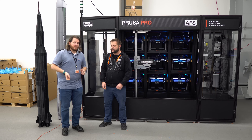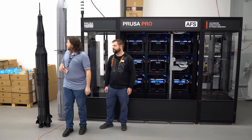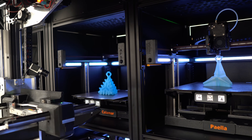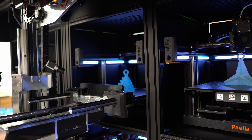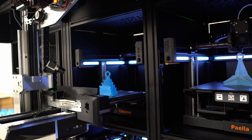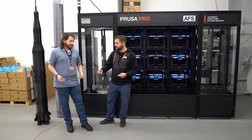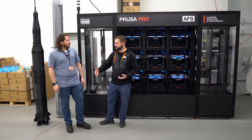Then you have to turn the dials up a little faster to catch up. Human factors are one of the biggest issues for failure amongst any business. Another point — this also comes into why we chose this size of print bed. Many people ask why we didn't make it XL size. XL size means print time is approximately one day or more. If from a two-day print the downtime is six hours, the yield percentage is reasonable. But if you have a lot of small prints — two, three, four hours — and the downtime is six hours until the operator comes and changes the print sheet, then the yield drops drastically, more than 50%. And this costs you money at the end of the job.